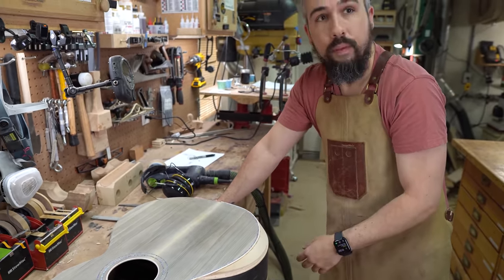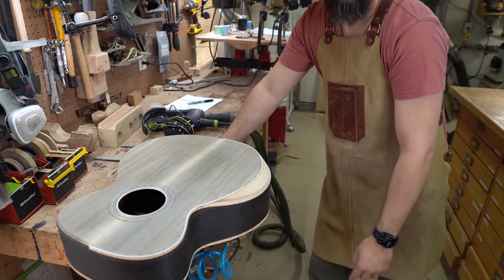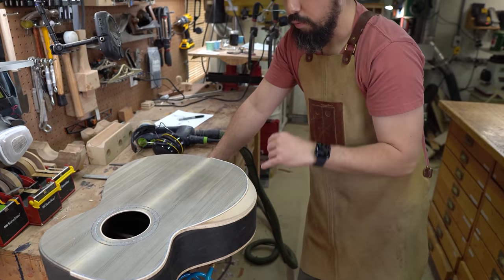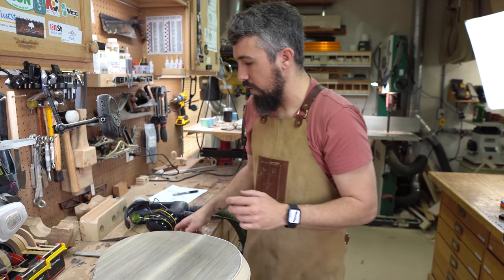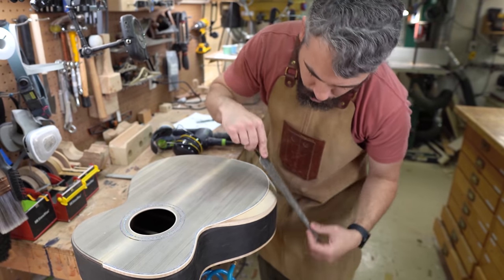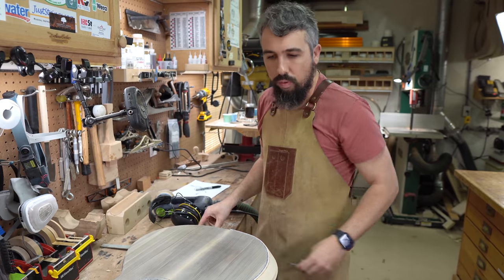Were you using the sacrificial pieces of wood there? Because I heard you clip those every now and then. Yep, basically using them as a bumper guide for this initial step. This is phase one of knocking this bevel into place. It's just getting your sander, or if I'm using a rasp, it's the same thing. We're coming in here, and I would be very careful to just touch the two sacrificial pieces of binding. Once those are connected, we know that we've got a good starting point.